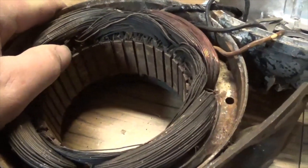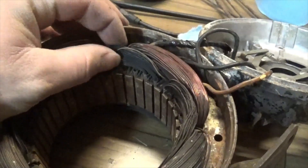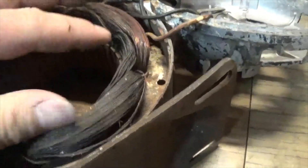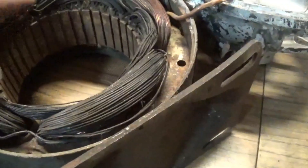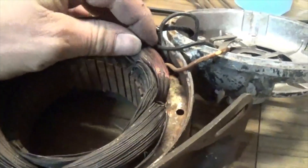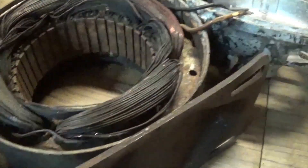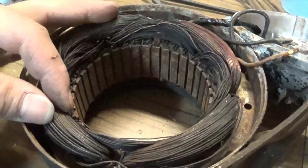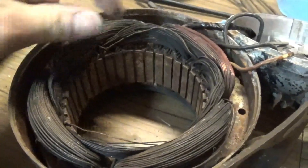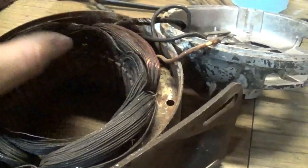I've been eyeing this thing up and I noticed this in the video too. I can't remember if I really noticed the significance of this back when I made the original video, but these start windings here are the only ones that are actually cooked. You can see that the run windings here, although they're a little dark, you can scrape it off. But the epoxy - whatever it is they dip these in to insulate them - it's still all intact on the run windings.